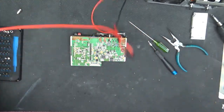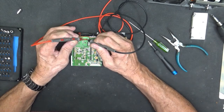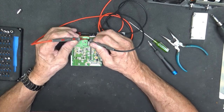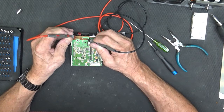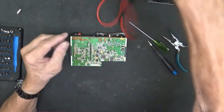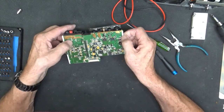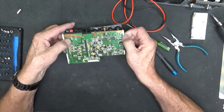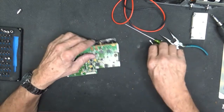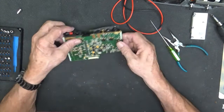We'll find out. This meter's only good to about 20 megs, but that should be enough. Yeah, well, it started off at about 10 and went up immediately over 20. Yep, okay. Well, it seems to be sort of conductive, but it's a lot less than I am. Unfortunately, it's over the top of some very tiny 0402 parts, and I'm not going to dig into that. Why would they put this stuff over? It scares me. Not going to do that. Okay. No.